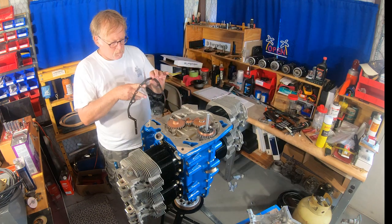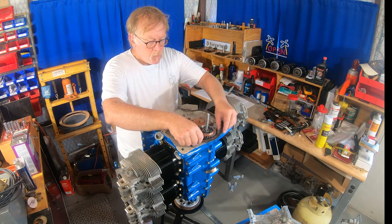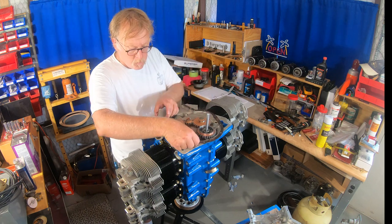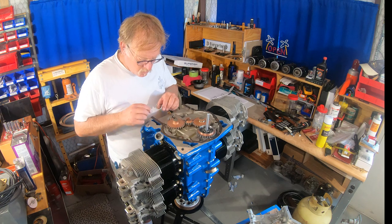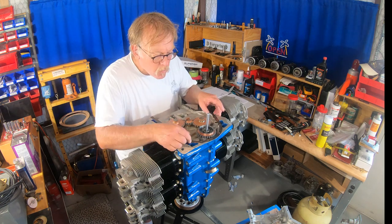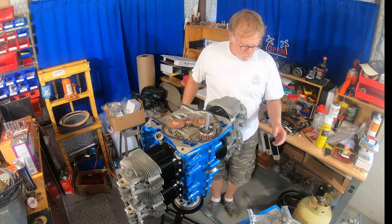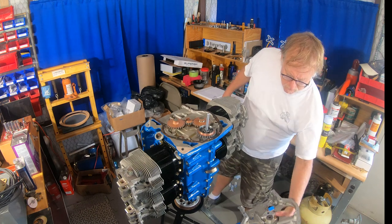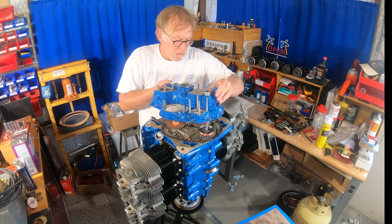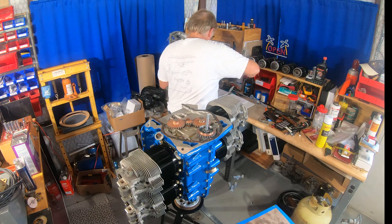Now what I like to do on gaskets, this is me, is I'll put a light coating of number 2 Permatex on it. That's just what I do, in addition to what the manual calls out. But I found that the Permatex is pliable. It's not too hard. If you have to remove the case, it's really not too hard to get off. It is kind of a flexible deal. It does very well. It doesn't get hard and crack and cause leaks. It works out pretty well.